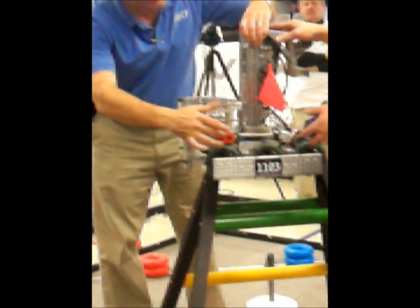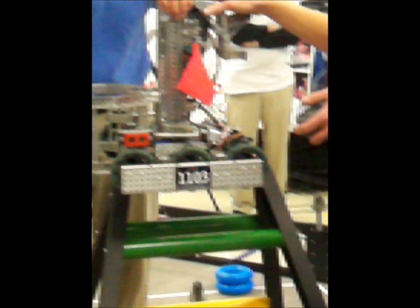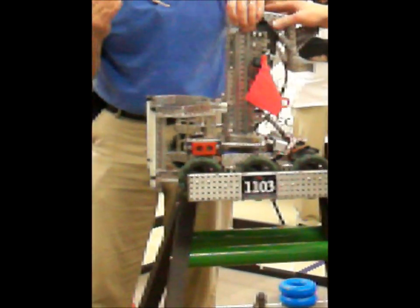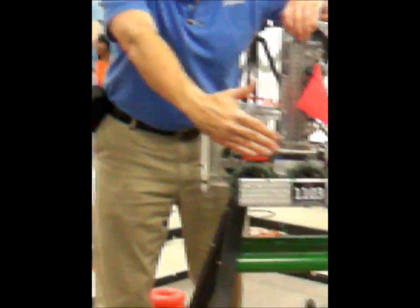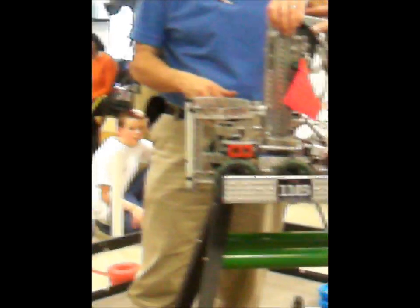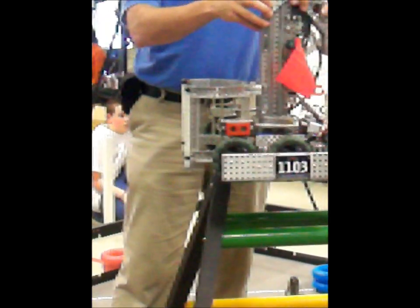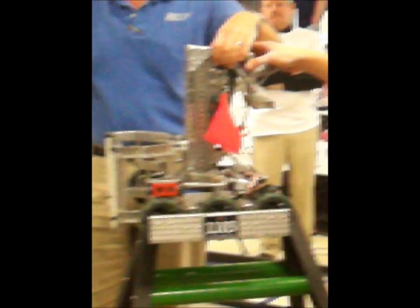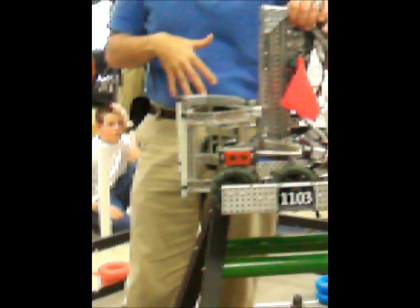You see these little red things on the side — these are the ultrasonic sensors. They send out a little ultrasonic sound pulse and time how long it takes to come back to calculate distance, so the robot can tell how far away it is from a wall on both sides. He also has encoders — a little red device buried in the drivetrain — that count rotations so he knows exactly how high the lift went and exactly how far his wheels have moved.